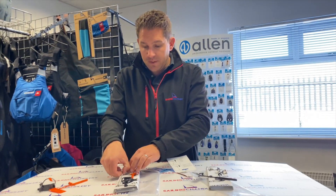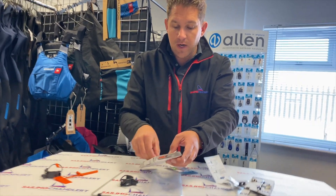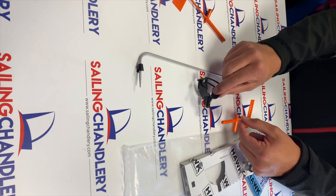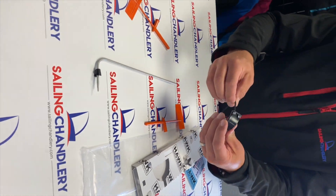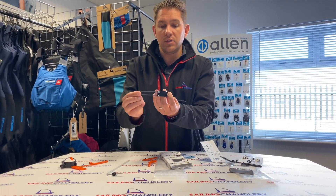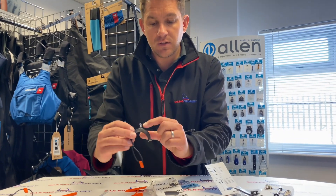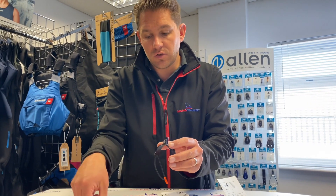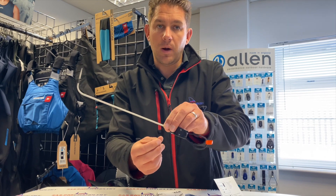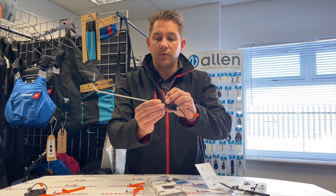So if we're looking to put this together, there are three bits. We can break those out of the box — you've got the rod, the bit that goes around, and the orange indicator here. So to put this together, the elastic is here and it can be adjusted — this is what wraps around your mast. When you're fitting this, you put it around the mast, pull the elastic round, clip it on, and it locks into position. When you're building this, there's a little screw underneath here, so you have to get a screwdriver, just unscrew this, put your wind indicator rod in there and tighten the screw up again. That will stay in place. Make sure you've got it square and sitting straight rather than on an angle — it's going to perform a lot better.